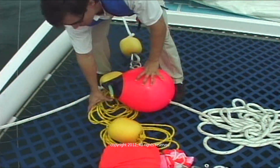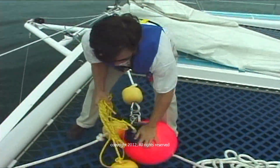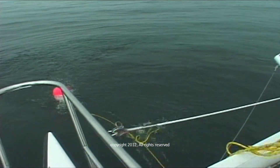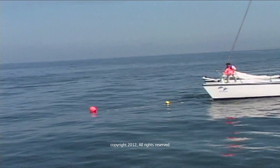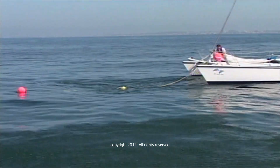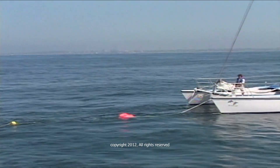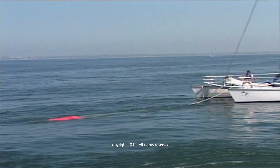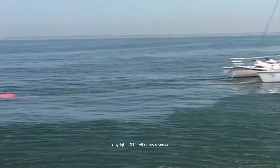A parachute sea anchor is a specially designed parachute that you can deploy off of any type of boat, be it a trawler, multi-hull, or sailboat. We attach an anchor rope to this parachute, and as your boat's drifting backwards, we drop the chute into the water. As soon as it sinks, it deploys rather quickly, putting tension on the line and pulling your bow into approaching weather. This stabilizes the boat and really slows your drift down — we're talking half a nautical mile to maybe a nautical mile of drift per hour versus 10 nautical miles without a parachute deployed.